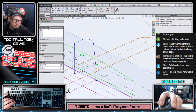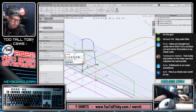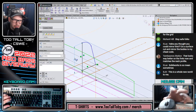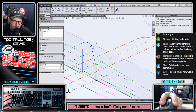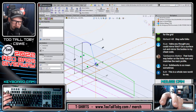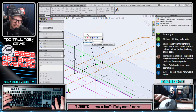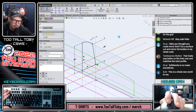And then let's give ourselves the height of this nut. At 0.1 it's going to be 0.33, and at 0.2 it's going to be closer to about 0.26. 0.33, and to here it's going to be 0.26, and then the angle of this line. I'll just click the line, click the end point of the line, use the magic handle, and put in the angle here. I'll make that 10 degrees. It's not much of an angle there.